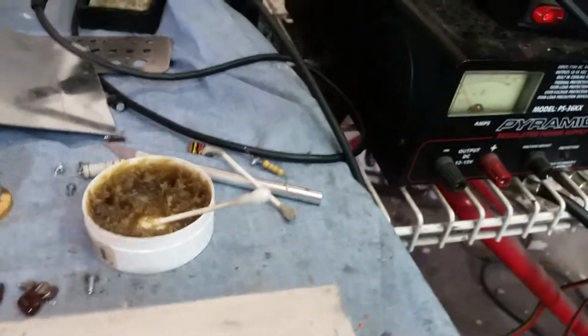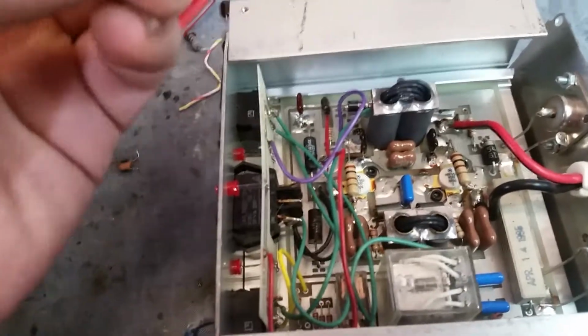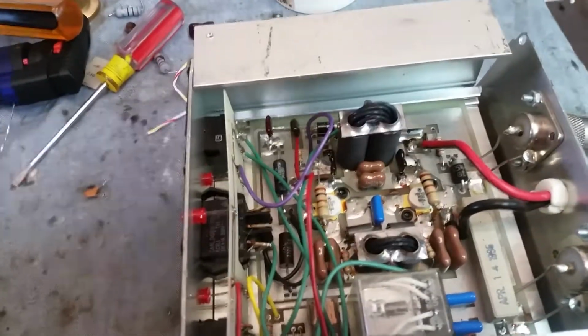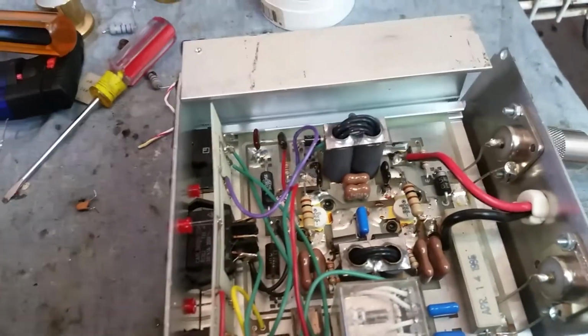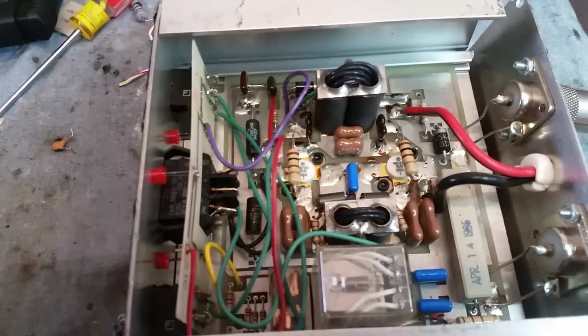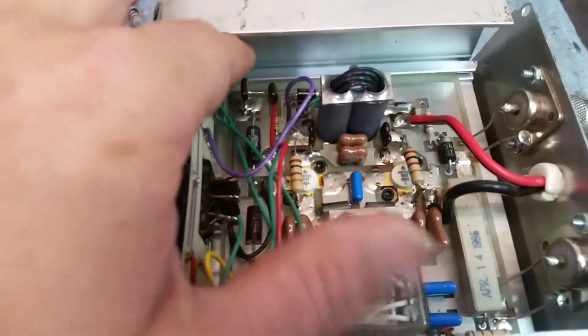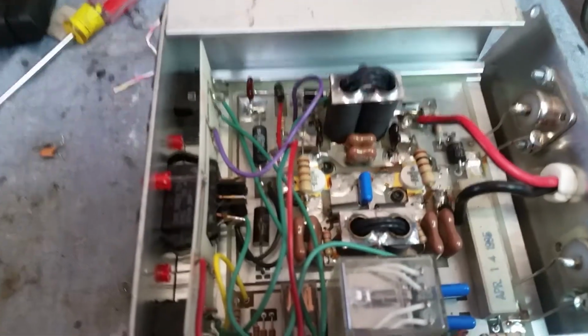Anyway, you said you had output reflect. And the reason why is the capacitor. I just did one of these repairs last week on this same amp, same issue. The output capacitor they chose to use for this amp is so freaking tiny, man. I cannot believe that they use it. It's a ceramic disc, tiny as a pimple. It blows my mind. It was a 27 picofarad, and I retuned it for you on the output. That's what this capacitor is right here.